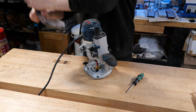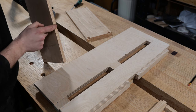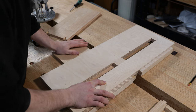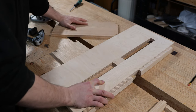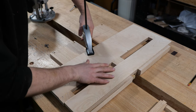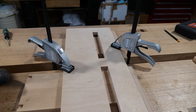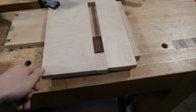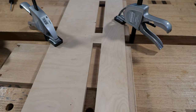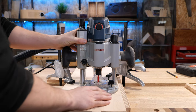To confirm the setup: the groove goes through from the back and stops before it hits the front edge, as indicated by the face edge mark. The component slots into the corner of the jig against both reference components. I'm also going to put a spacer under the back to ensure the jig stays level. A clamp goes on — being careful not to get too close to the groove or you won't be able to fit the router past the clamp. The guide bush slots into the groove with no sideways movement whatsoever.